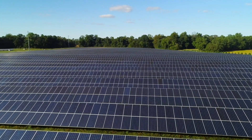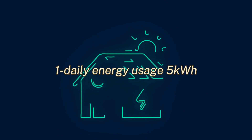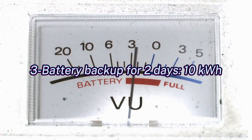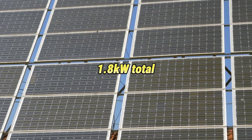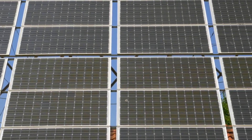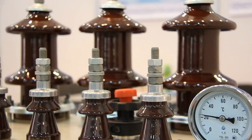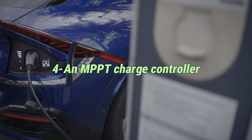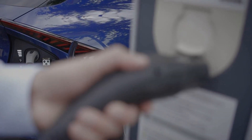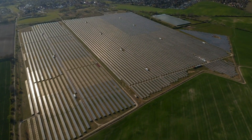Let's pull all these components together with a practical example. Say you have the following requirements: daily energy usage of 5 kilowatt-hours, 5 peak sun hours, and battery backup for two days (10 kilowatt-hours). For this setup, you'd need: six 300-watt solar panels (1.8 kilowatts total) to ensure consistent energy production; four 200Ah lithium batteries for a total of 10 kilowatt-hours of storage capacity; a 600-watt pure sine wave inverter to power your appliances; and an MPPT charge controller to efficiently manage power from the panels to the batteries. This system will keep your home running smoothly, even on cloudy days and through the night.